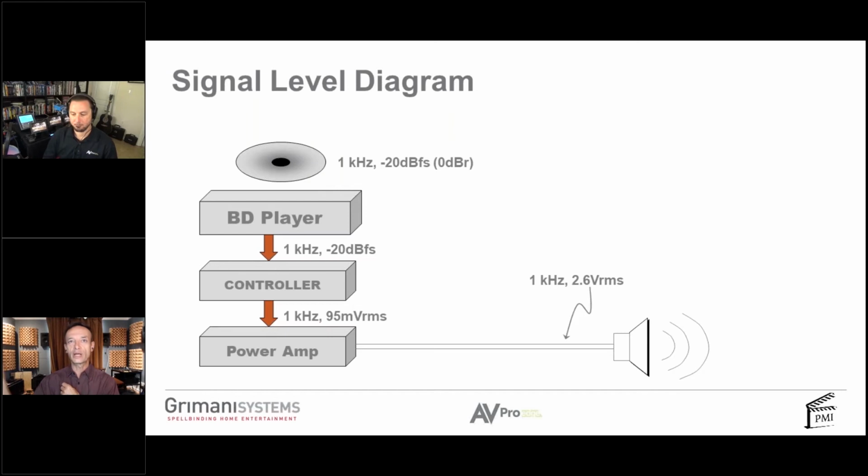I do recommend, if you're designing the system and you're going to be calibrating, that you actually run little probe wires down behind the speaker to a little hidden location under each speaker, so you can go measure it. A little trapdoor or something. Or just a little pair of test points that you can see at the bottom of the fabric that nobody else can see, but you know. So you can just touch them with your probes. Yeah, that makes sense. Cool.